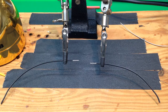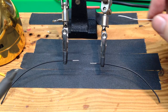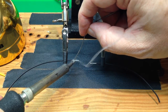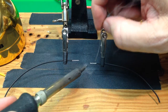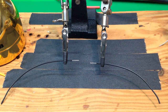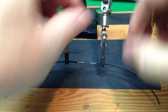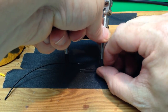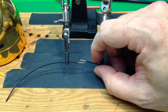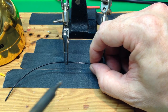Sometimes we have to solder some really thin wire, or a wire that we can't get enough of to wrap together. Basically what we're going to do is tin each side with a generous amount of solder, and then melt that solder together. This is only good for really thin wires — you don't want to do this for anything thick that's going to take a lot of strain. But for thin wire, sometimes it's the only thing you can do.